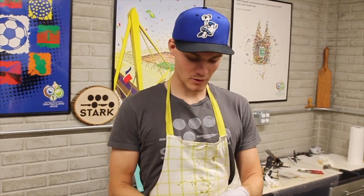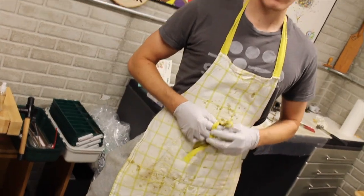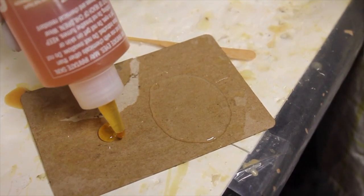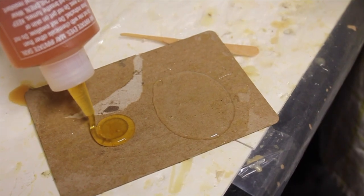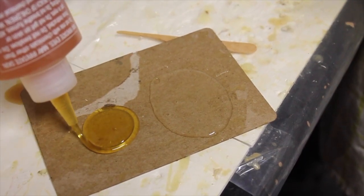Before gluing, it's very important to put on the proper clothing, such as glue-stained sweatpants and glue-stained aprons. Now I'm going to mix up some G-Flex epoxy to glue in the PVC to the flange. I like using G-Flex because it was originally developed for fixing leaky boat holes, so if it can keep a boat from leaking, it should definitely be able to keep the acid from leaking.